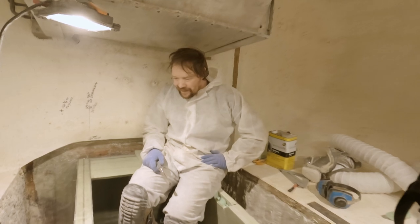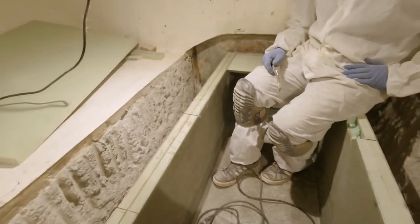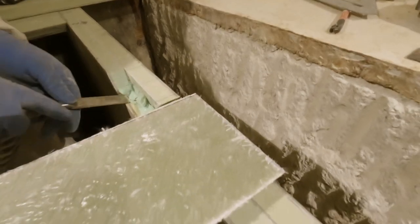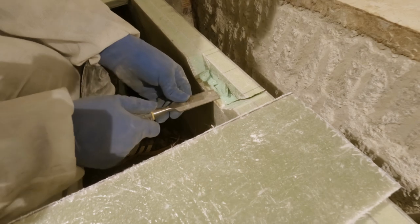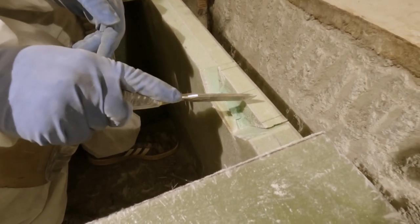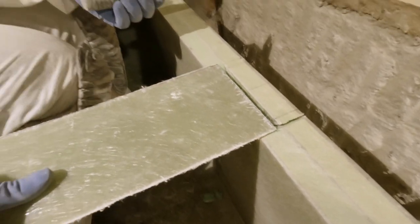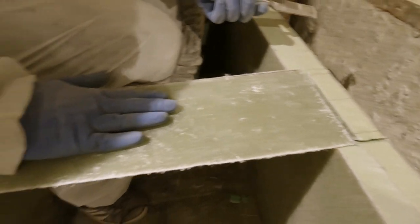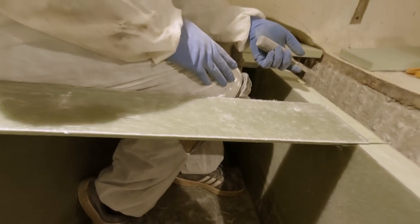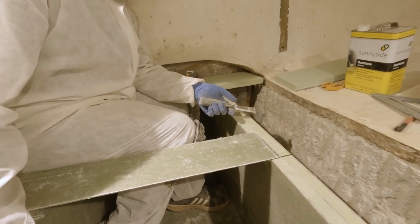So we were going to take our piece here and put it all the way across like that and notch it in. But upon cutting this and thinking about it, probably just take out this center web and the foam and leave this outside layer of glass - just put it up to that. So it's basically just going to slip in there like that. While this has some bend right now, once you glass another layer to this and then another layer on top of that, it won't have any more bend - it will be extremely rigid at that point. I think that might work good. I'll just try that first and we'll see what happens.